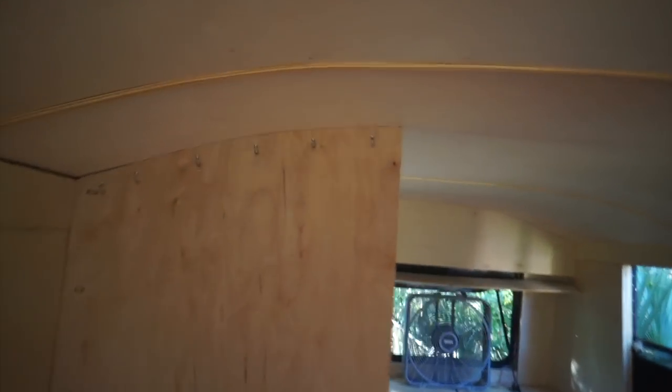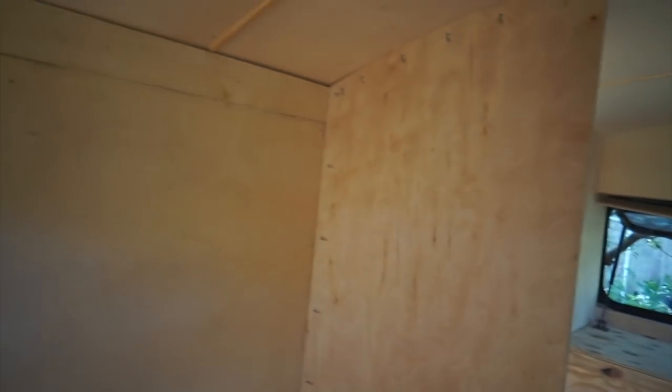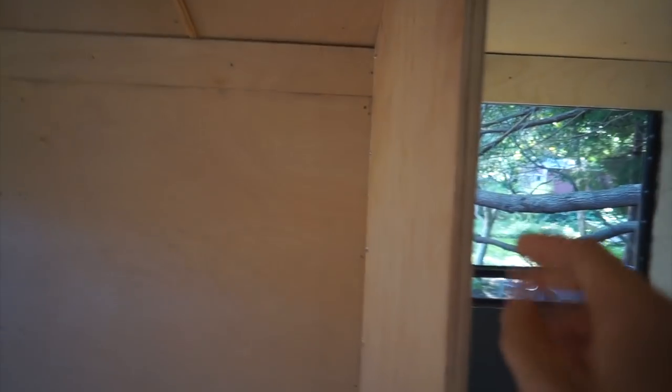Yesterday I had a couple hours, and you saw me make this one — it worked out really well except for that little corner, no problem. I wanted to mention it's really sturdy, okay, except for right here — watch, see how I can wiggle it? Obviously that's not good enough, but there's gonna be a second wall right here, a shelf that will tie to here, and also the bed which will tie in right here. When that's done I am very confident this is going to be really sturdy. This is my way of building walls with only three-quarters of an inch. I think that's pretty cool — with a stud and half-inch sheeting I'd lose two inches no matter what, but this way I lose only three-quarters.